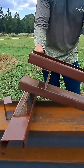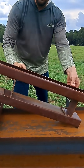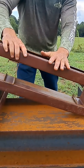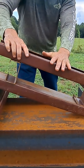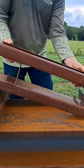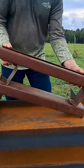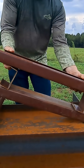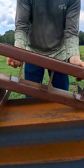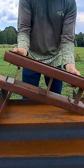Now let's pretend that this is a 4/12 pitch or a steeper pitch. You've got that steeper angle, and you're also increasing the shear load of your snow load. If you have the same amount of snow, the same weight bearing down, you're more likely for those clips to give out, shift, and break. So when you get a steeper angle, by adding an extra piece of purlin in there, that's one more clip, one more weld to help hold you in there.